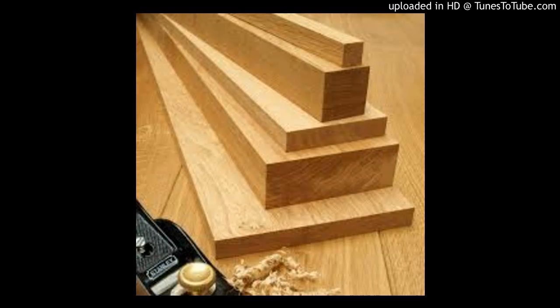Well, that was the easy way to do the deck, with the boards running crosswise. Now, we're going to do it the complicated way, running them lengthways. And this is when the relationship with the posts and handrails and everything becomes an issue. So we've got our same deck. It's 12 metres by 3.6. So we swap the direction of the bearers, and they're extending the 12-metre length. Now, I was a pretty good sawmiller, but I couldn't cut 12-metre lengths.